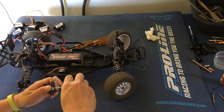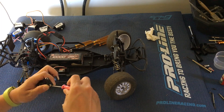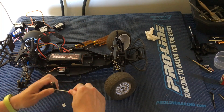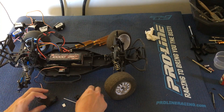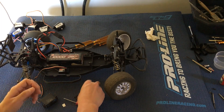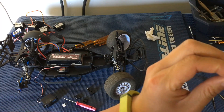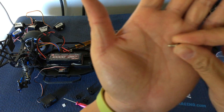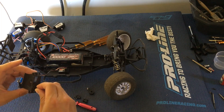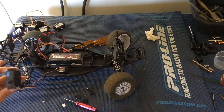Just want to make sure this works — but it looks like I might have to find another screw here. The thread on the screw is not appropriate. Let me show you: that is a coarse-threaded screw, and just from the feel, the screw isn't going in very smoothly when I turn it. I don't want to cross-thread this servo.